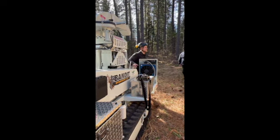So per Bandit's manual, for 40 pounds of downforce on this tool, they want about a 1/2 inch deflection. I'm not the biggest fan of that recommendation because your 40 pounds of elbow torque is different from mine, different from yours, and so on. So, you know, I may walk by, I may say, hey, this belt's nice and tight. You may walk by and say, hey, this belt is loose, and now we're sitting here arguing with each other about it. My recommendation before you take this machine out and start chipping, everyone just take this tool, put it in that hole, get a feel for how tight that belt is. It's how tight that belt should be. If it's any looser than that, again, just do your adjustment.